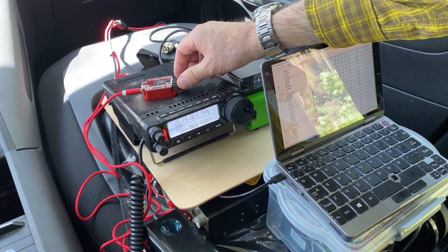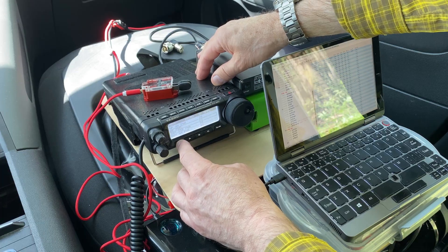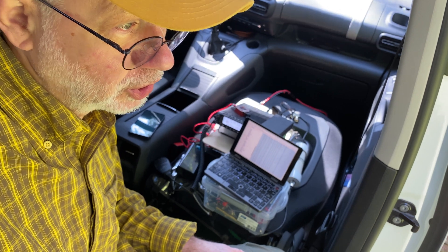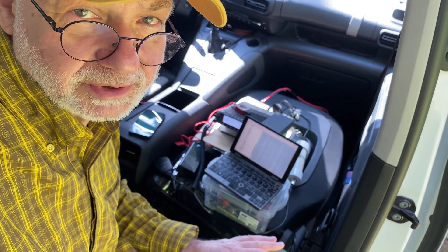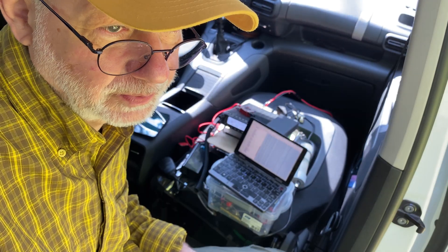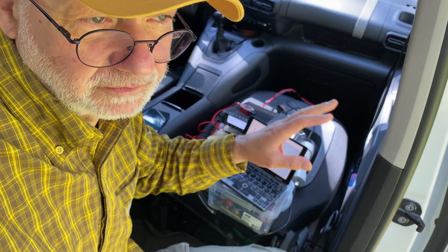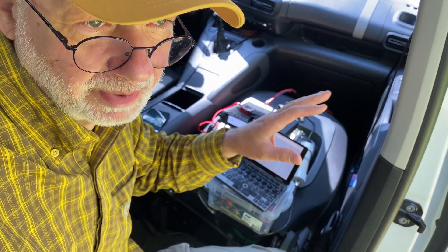But it's totally okay for lower power applications, like using it with the Micro PA50 or similar 40 to 50-watt power amplifiers. The CG Antenna Unun, which was the device under test today, it works — it definitely makes all the impedance transformations, which is good. My AT100 Pro tuner could tune all bands with no problems, even on 80 meters. The first impression is the Unun is very nice, very small, very lightweight, good for packing and carrying. It works very well even with higher power on 40 and 30-meter bands, but gets some problems on higher bands at this power level.